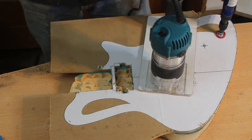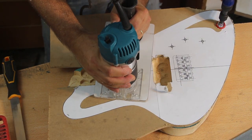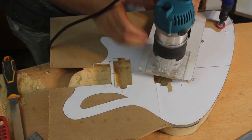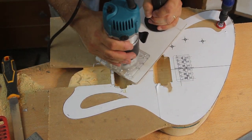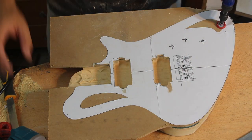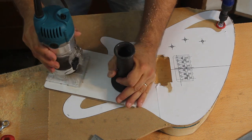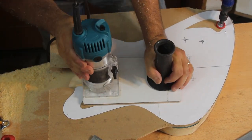Since I'm using pine for the prototype I'll use my trim router — it can handle it. I'll still do it in two passes and start with a very short bit. If your template is made from thicker material you'll have more wiggle room with the depth. Since I'm routing a few extra millimeters under the pickup for adjustment and wiring I leave the rounded bit on and get a nice rounded bottom. This won't work for the neck pocket, which needs a deeper cut, and the longer straight blade will be perfect for that. I'm leaving the heel of the neck straight and will just slightly round it to match the router radius — about 12 millimeters.